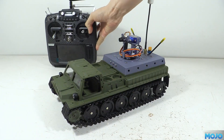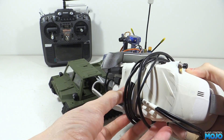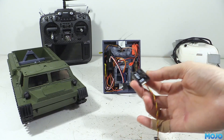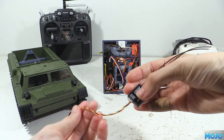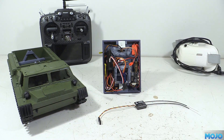The Jumper already handles the camera gimbal on the back as well as the head tracker that's taped to the FPV headset. All we really need to add is a couple of ESCs to drive the track motors. But I'm a bit prone to feature creep, so I started designing a complete control system. It really started because I wanted to use one of these little RadioMaster receivers. It uses the FRSky D16 protocol and connects using SBUS — so rather than pulse widths, it sends the channel data through a serial connection.